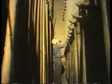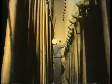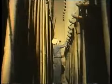And while you're in the area, be on the alert for leaks. If you find a leak in the superheater or reheater tubes, the area around them should be inspected for blisters. Blisters are an indication of overheating. Blisters can be pretty hard to find, especially if they occur on a tube inside the superheater bundle. One way to check these hard-to-find blisters is to shine a light along the length of each tube. And if a tube is blistered, the blister will cast a shadow.